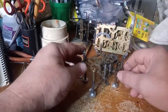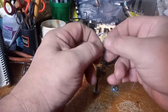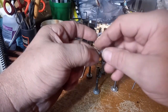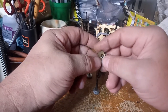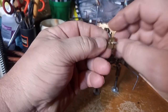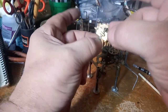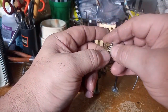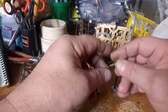Strike side — we're going from top side down. The strike side has a fly on it. Take the fly off like this. If that fan spins several times, it is too loose — your cuckoo will cuckoo too fast. You need to tighten up the wheel: take this fan off, push this center arbor down some, and put the fan back on. Spin it — if it can only move a quarter to half a rotation, you've got it too tight and your cuckoo will cuckoo too slow.